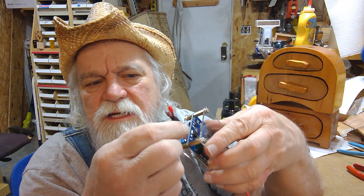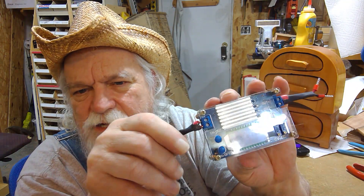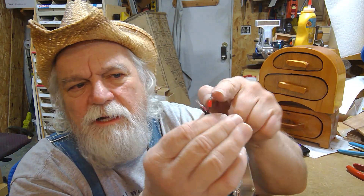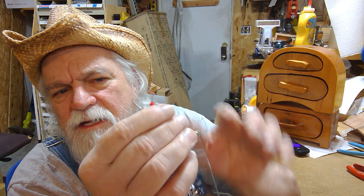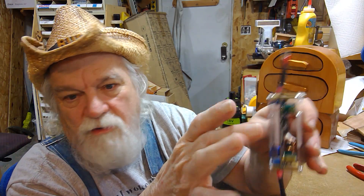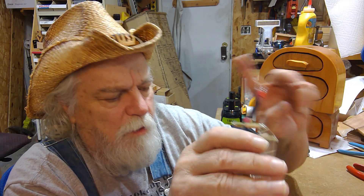These terminals are very handy to make and to have around, and they're very durable. Once you put them on there, if you really want this thing to be strong, you can put some hot glue around it once it's on. That thing would be a rock solid connection all the time. Then do all your connections out here — you can either use alligator clips. I used wire ferrules out here as well as on this end. So by having these on there, I can hook alligator clips while testing or solder to them for a permanent connection.